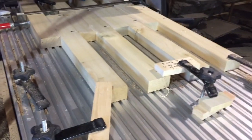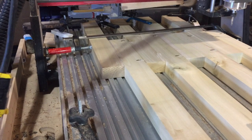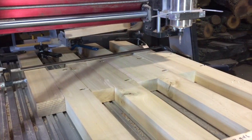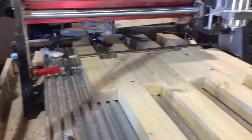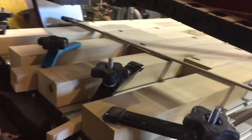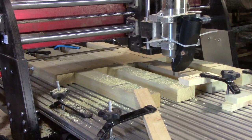Each one of the legs is clamped down on both ends and they're clamped together with that clamp. If you look at the clamp it just fits in between the CNC - it clears a lot of space on that side. Before I cut I actually run it from one extreme to the other because it's 21 and a half inches from here to where the second cut ends - I wanted to make sure I had that much movement. I actually have extra - I can go another eight or ten inches further but I don't need to.